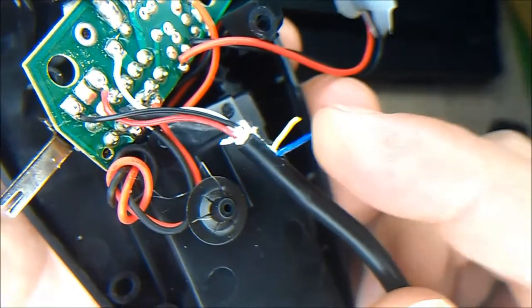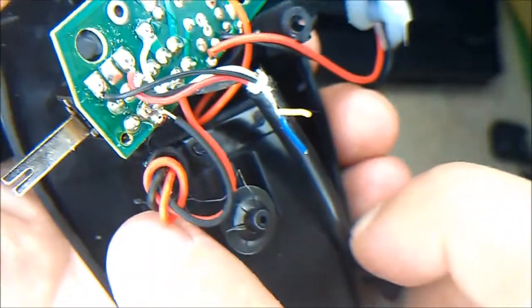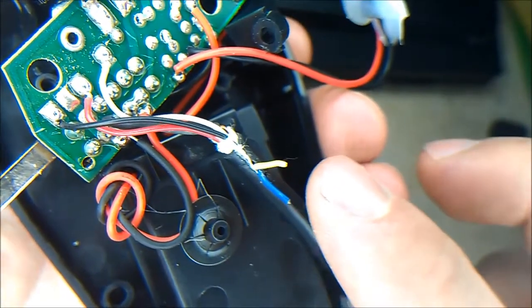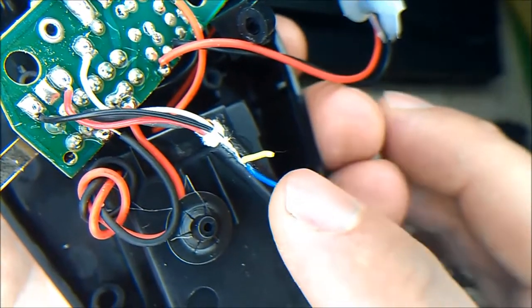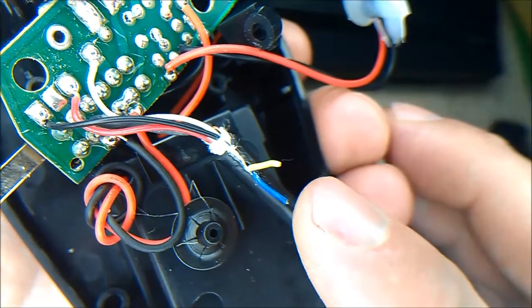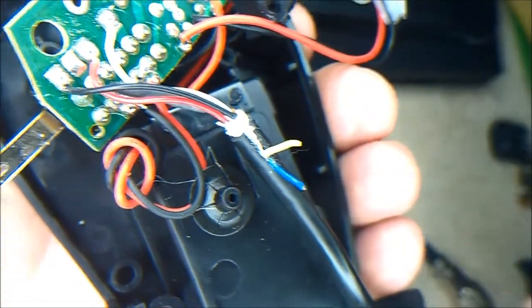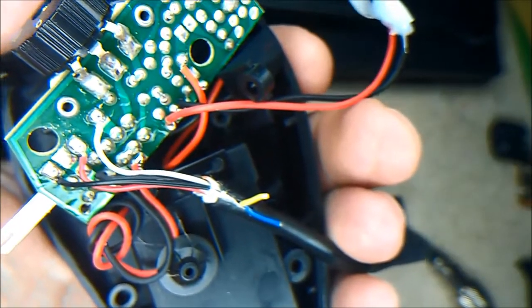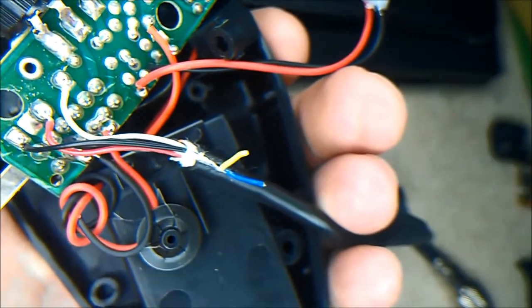The HiGear microphone has two extra cables which we can tie up to the battery lead, so the microphone can be powered by the radio itself. The radio puts out about 7.8 volts on pin number six when unkeyed and eight volts when keyed in. By connecting those two extra cables to the battery compartment, the microphone will run off the radio without a battery pack. Let's get to the soldering.